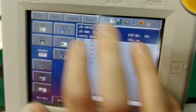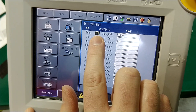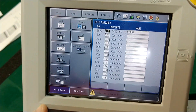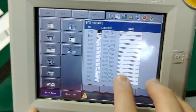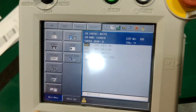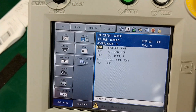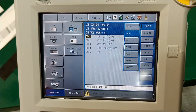If I go into the variable and I want only the first two bits to turn on — value three — I would put that in there, and then it will read that value and turn on the representative binary signal. Those are some cool tricks you can do with digital inputs and outputs.